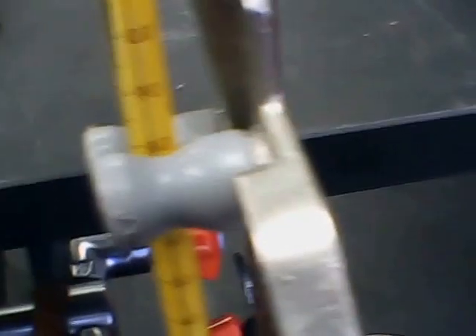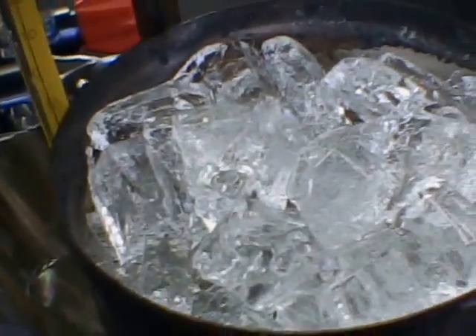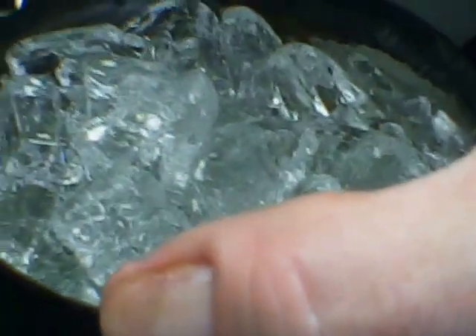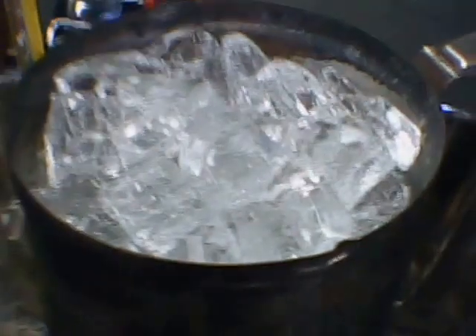You can use glycerin, but if there's any water in there it's going to be smoking, driving off water vapor and any organic impurities. I like the silicone bath as a thermal medium. I'll hook these up in series. I have a water-cooled aluminum block often used to cool CPUs, and I'll put three of these on an aluminum block. We're at 1.30 volts. With three of these at about 110 degrees, that's pretty good — we're steadily climbing.